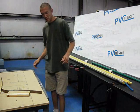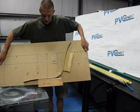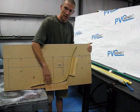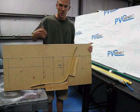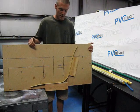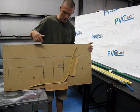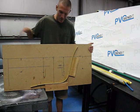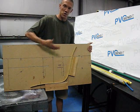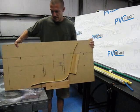Moving on, what I'd like to get into is how to do a more complicated form than the Build-A-Bend system allows. This right here is Formica — the end strips for putting together countertops. It works great. You can use other things like bendy board, thin flexible plywoods, and things like that; this is just what we chose to use. It's hot glued down to make the shape of a camp chair. What we're making isn't really that important because I'm just trying to show the principle.